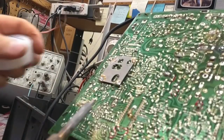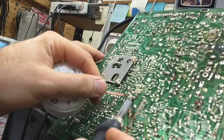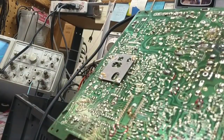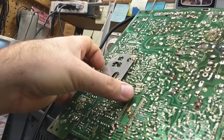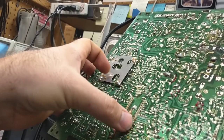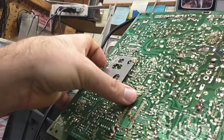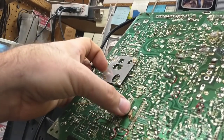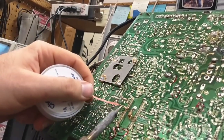You want to make sure that these are as loose as possible, otherwise you could damage the foil traces getting the old part out and the new part in. In fact you could even push on it just to check and see that all these are loose. Don't push too hard, otherwise you could have a lead go through your skin and that's never any fun. So pushing on this — this side goes through the board, this side there are still a couple of points that are attached.